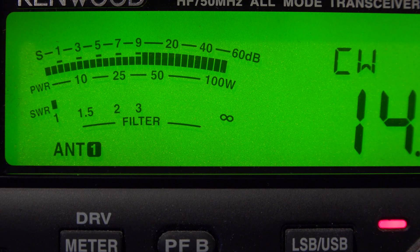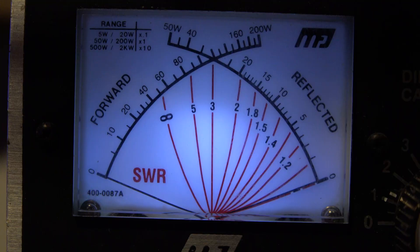This is the 20-meter band on CW setting, power output set to 100% — 100 watts, whatever it's supposed to be — fed into a 50-ohm dummy load. So the SWR should be basically zero and no signal is going out to the airwaves since this is just testing. From what I can gather on this meter, it appears to be 100 watts, but in reality it just isn't.